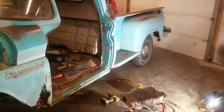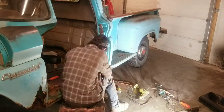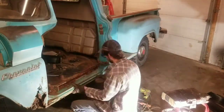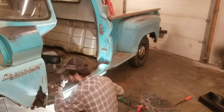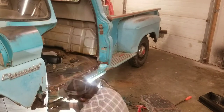Once that's done, I start cutting off the old rocker panel. I kind of like to take my time doing this. It's a lot easier to take something apart cleanly than to just go at it with an air chisel and make a giant mess, tear a bunch of holes, and bend everything all to hell — it just makes putting everything back together a lot more difficult.